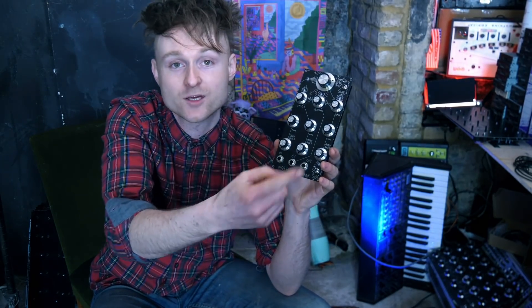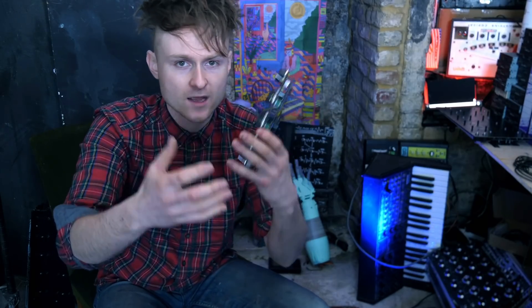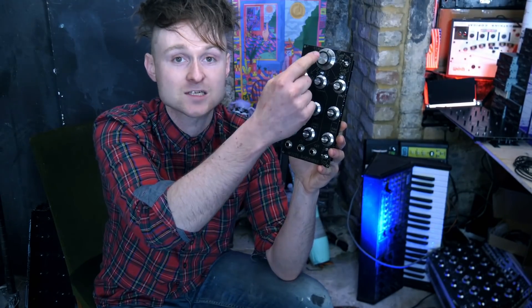What I did with the Triple Splashback is basically triple this sketchiness and make it into a single module. This isn't the only machine that uses more than one PT 2399 chip — a lot of cheap reverb effects pedals actually use three PT 2399s with offset echoes to give the feeling of a spring reverb chamber.